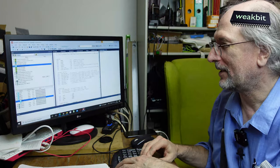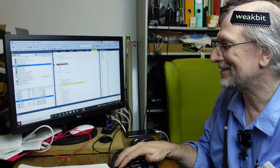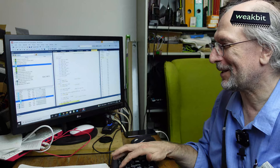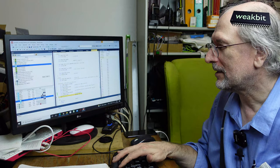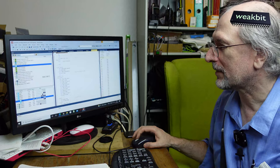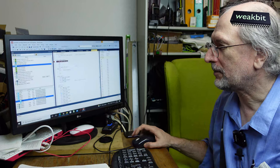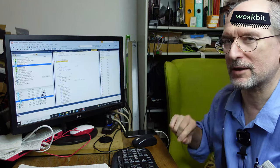So that takes me a couple of days, because I'm not so perfect in programming. But I found out, here's my little program, that I can initialize everything and a timer. I initialize a timer and repeat it cyclic every 10 milliseconds. I go here and I'm waiting for an interrupt, run to cursor. It's 10 milliseconds and 116 microseconds.